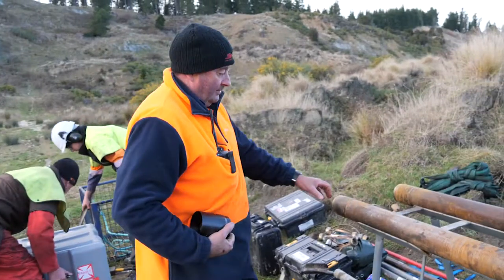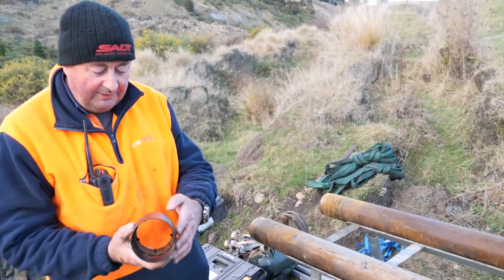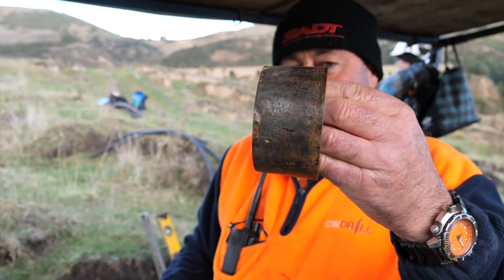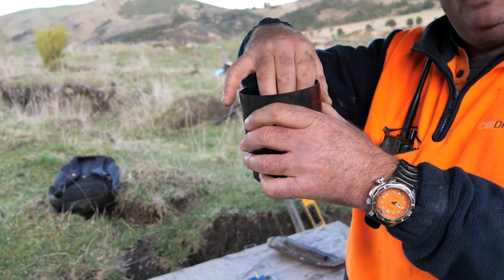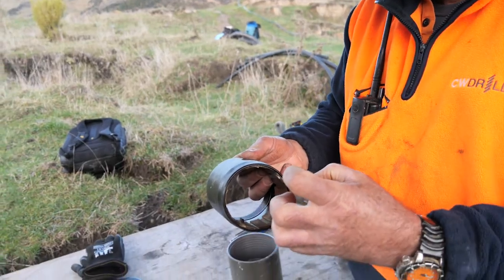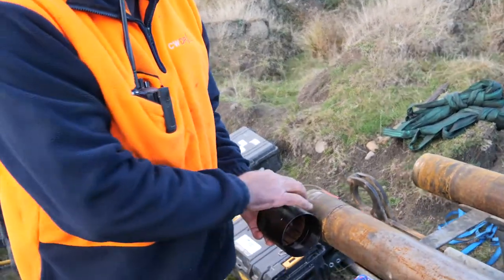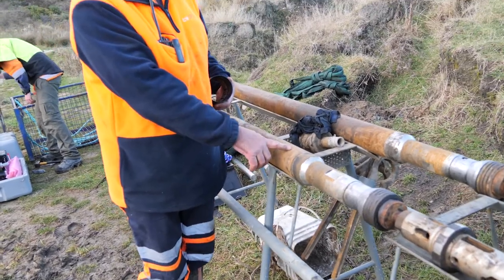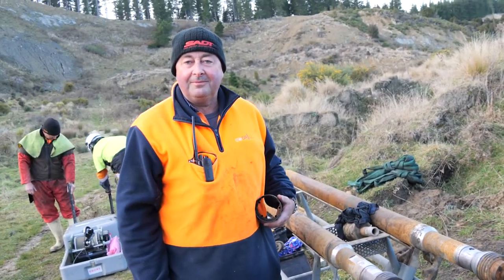This inner tube slides down and locks into place. On the end of the inner tube we have our lifter and lifter case. The lifter is tapered, and the inside of the lifter case is also tapered, so as the rock you've cut goes up inside it stays in there. When you want to come off the bottom, the two tapers pull together, shrink in, and grab hold of the core. Once you've cut a full tube's worth, you extract it using a wireline — you send a wireline down the hole, it locks into the back of the inner tube, and then you extract the core.